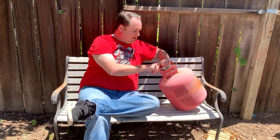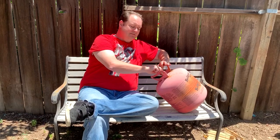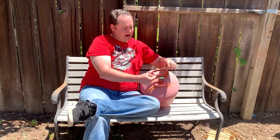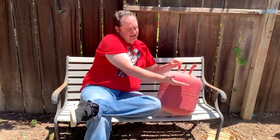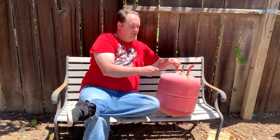So that's going to be the first thing I'm working on. What's involved is: I need to make sure I get all the helium out of here. Then we're going to cut the top off. Then I'll weld on new handles and a base to hold it in place. Then we'll fill it with refractory cement — I'm going to use a homemade mix that I found on the internet.